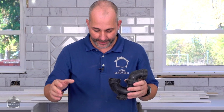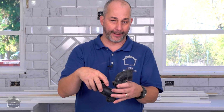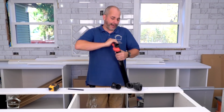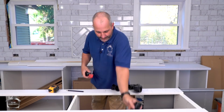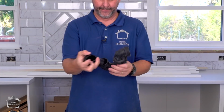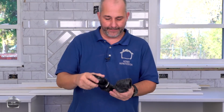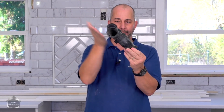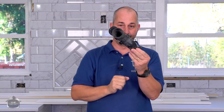But the P-trap, if you put it underneath, if you have a finished basement, you might not have enough room for that. But what you can do is you can install your P-trap on an angle. And what I mean by that, okay, you can actually have your P-trap like this. It can be on a 45 degrees in between floor joists, right?